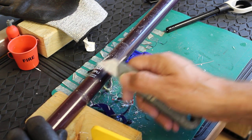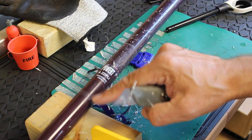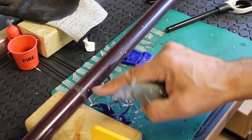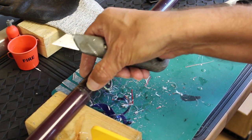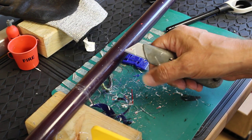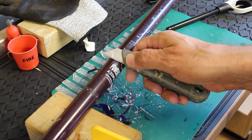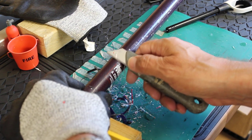Okay, and there we had the 1-inch gap between the end of the shrink tube, and you can see the end of that shrink tube, there's the mark there, but we also got a bit of water penetration in there, salt water. So I'll show you what to do to seal that when we come to it, to stop that from happening. Okay, so you're always thinking ahead.